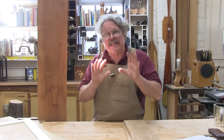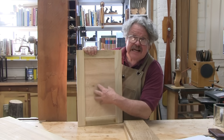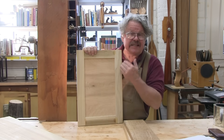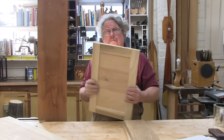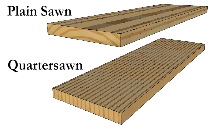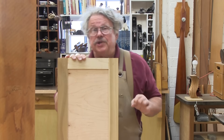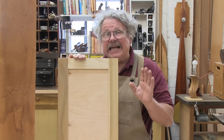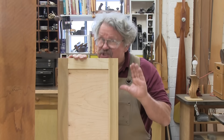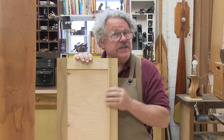When you're working with wood, you must allow for this movement. A panel door is a great example — the panel floats in grooves so that it can expand and contract, and the frame keeps the panel from warping or twisting. The rule of thumb is to allow for one-quarter inch (6 millimeters) of movement across 12 inches or 30 centimeters of flat grain, and one-eighth inch or 3 millimeters across the same amount of quarter grain. If you need to glue two boards together with opposing grain directions, the elasticity of the glue will provide some movement — keep the length or width of the joint to under 3 inches (7.5 centimeters).